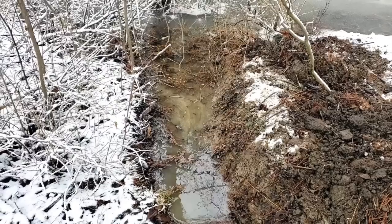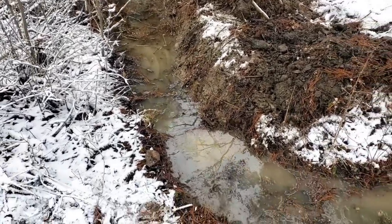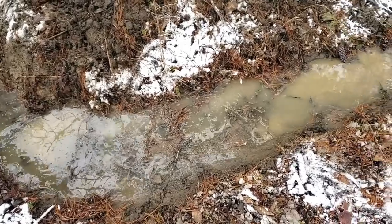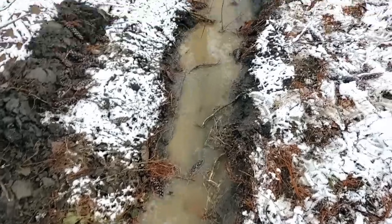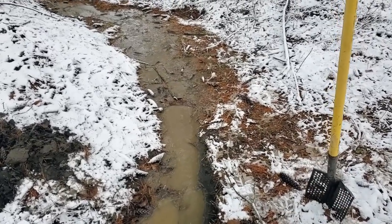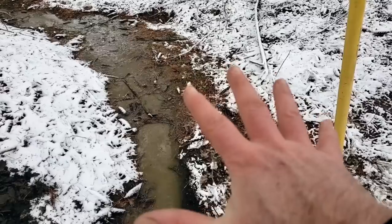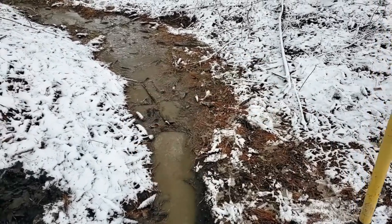so I might do that. Cutting a little further down channel definitely draws the water down a bit more aggressively. Nothing too crazy. I'm not seeing whitewater rapids or bubbles and all that, but it's moving. And it's doing what I would like it to do, which is to spill out. So in the spirit of reducing erosive forces, whenever you can, have a channel relax, make a delta, spread, and then if it needs to, become a channel again.